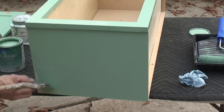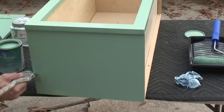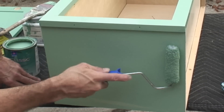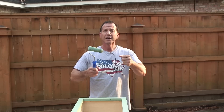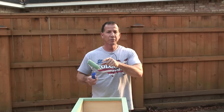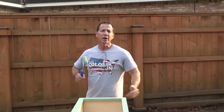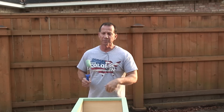If this was up against the wall, you could just cut it in and roll as close to the wall as you can, or put some tape on the wall and get your roller right up to the end. I recommend getting a couple of rollers — at least two to three when you do this. If you have to wash it and come back and roll again, make sure you dry it real well. Take it in a rag and squeeze it back and forth. If you roll back on this with water on the roller, you will have blotches on your paint and it could possibly run too.